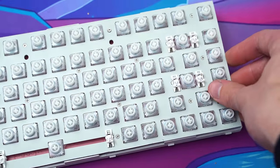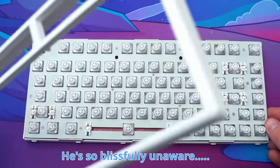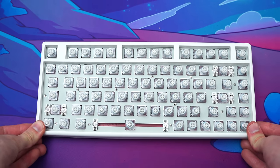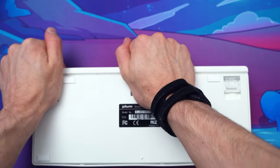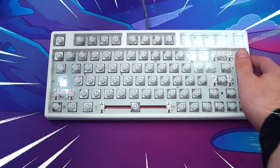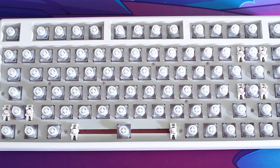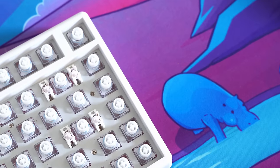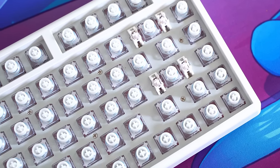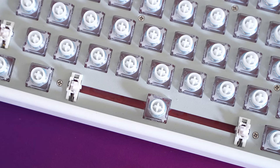Thinking my build was entirely ready, I decided to slot it in and commit to the point of almost no return. I was worried the PCB wouldn't make a proper connection to the daughter board of the Micro 84 — but it fit! Oh my gosh, it actually fit. So I plugged it in, crossed my fingers, and — it lit up! All the keys work! This is the most excited I've ever been. I Frankensteined two boards together. But I was in for a massive shock — no pun intended with the electrocapacitive thing. This uses cherry stabilizers now, and an issue was about to happen with the spacebar stabilizer that arose from the warp.